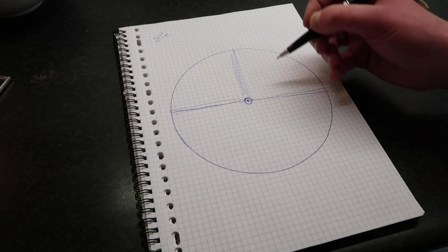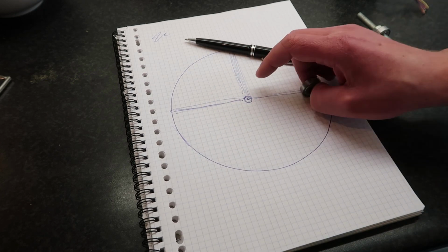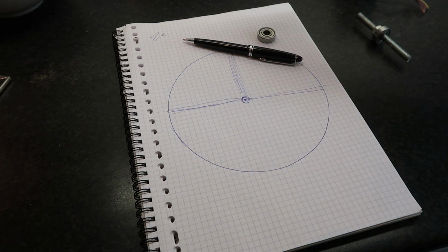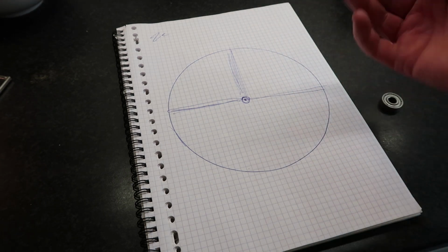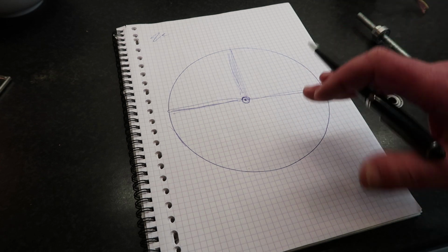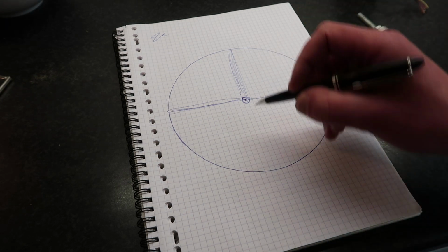Now what I thought was, you know what? I'm gonna use these bearings since they don't induce any noise and they don't tend to rattle as the marbles might do when you measure the thing. So what I'm gonna do, I'm probably gonna use 3, because 3 points of contact is usually the easiest, because no matter if one is higher or not, it will level out on its own.